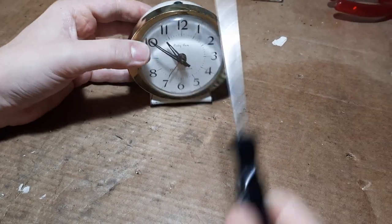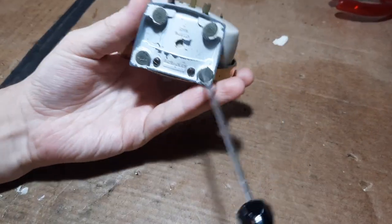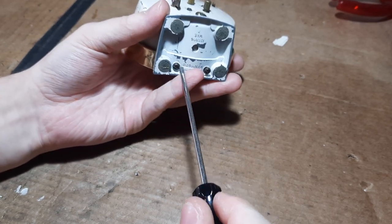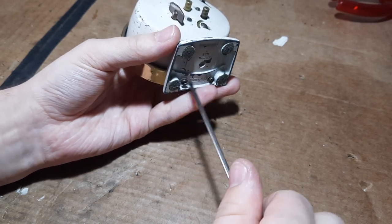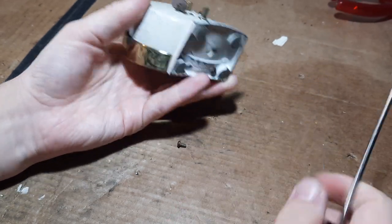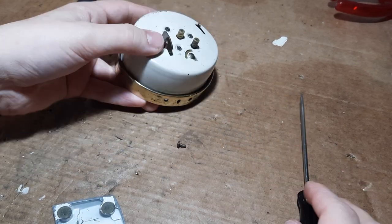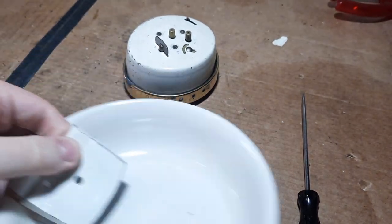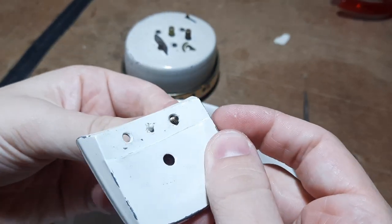Right, let's get into this thing. First of all, I like to take the bases off because with the bases off it makes it easy to take the bell off the back - it's easy to scrape the paint of the bell. By taking it off first, keep the screws at hand, put them in a bowl. There's a nice little locator lug on there.